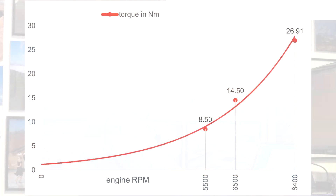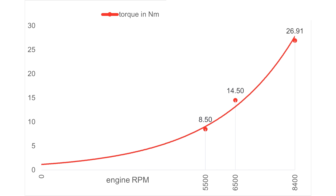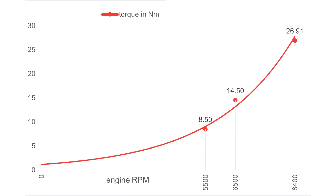The most interesting part is to look at these numbers in a chart. We have three dots — those are the numbers from the measurements. It's crazy how accurately they fit the square trend line. Absolutely, the measurements have confirmed the theoretical predictions: torque is a square function of propeller RPM. Increasing the RPM of the prop twice will cause the torque to increase by four times.